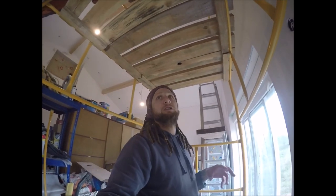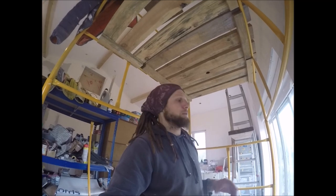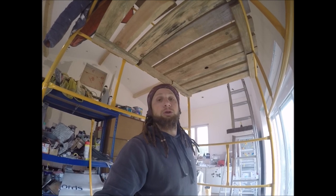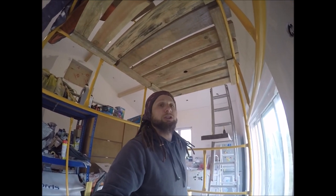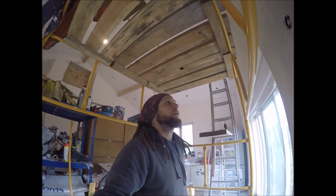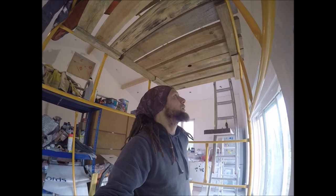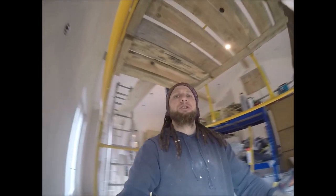But if you're watching this video to learn about how to use Lutece and you're not very good at plastering, then I must admit I would 100% recommend coating your whole new plasterboarded wall in a PVA watered down mix or SBR, just to give you a bit of time. Obviously me and Nick have been doing this for years and we're pros at it, so it's not too big a deal, but yeah, you could really get yourself in trouble, so be warned. Right, we'll come back when we do the second coat.